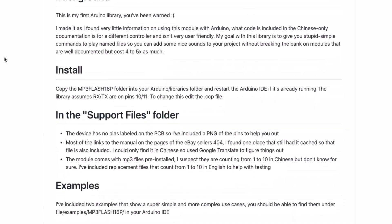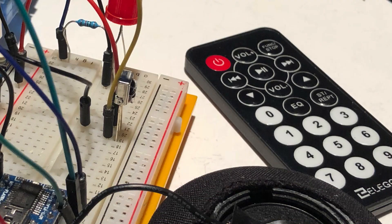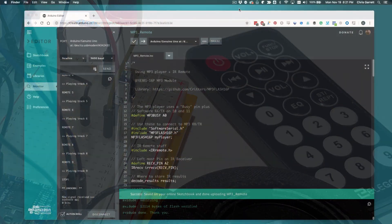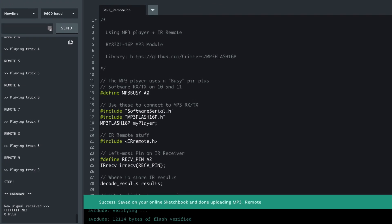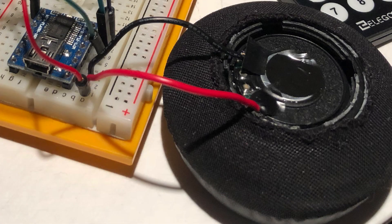For this project I'm using the infrared remote again, and I've pressed each button in turn to get the hex code of each of the numbers on my remote. I'm also using the stop button, so I can play a numbered file and when I'm sick of hearing it I can press stop and play another one. Out in the serial monitor I'll show what it's doing, and if an unknown signal is received we output the hex code so we can detect it next time. It plays pretty nicely — I'm playing it through a hacked speaker extracted from a broken set of headphones.